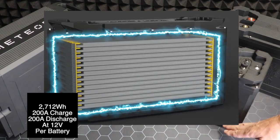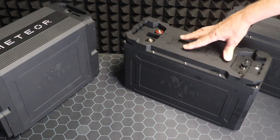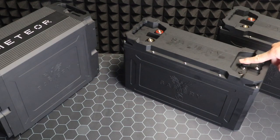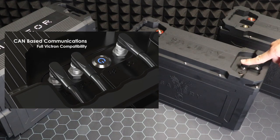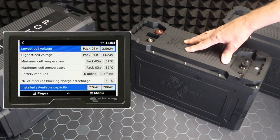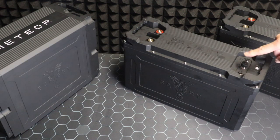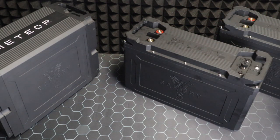We're buying the wafers directly from an EV supplier and putting them in our case. The BMS in here is the same BMS we have in our Meteor battery, which means it's Victron compliant — so there's no need for a shunt. This will read the battery directly and bring it up on the display, making this battery fully compliant with the Australian standard and also the marine standard. When you link multiple batteries together we use the secondary data bus. There's an on/off switch to turn it on, and you can turn the battery — or the whole train — on remotely with just one press of a button.